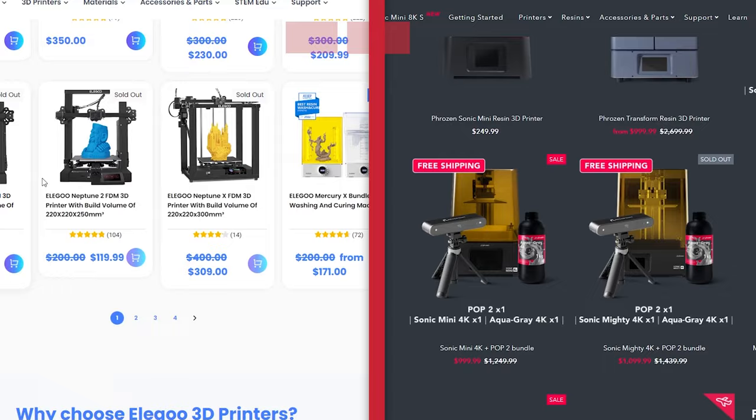The difference in material use is evident with larger pieces. This dragon head prop was made in 11 parts on the resin printer, weighs 1,230 grams, and took 87 hours of printing. On the FDM printer, the same head divided into 8 parts weighs only 700 grams and took just over 72 hours in low quality. Due to limitations in printing thin parts with filament, some 32mm miniatures like those with weapons, claws, staffs, and wings are very challenging, and the result cannot match the quality of resin prints — though they're still better than paper characters for gameplay.